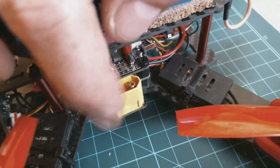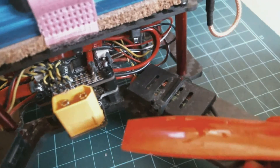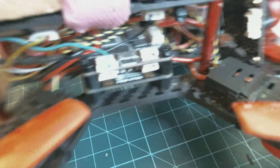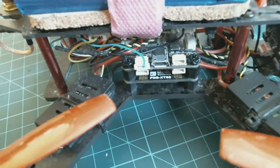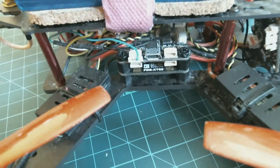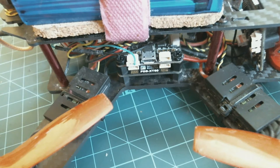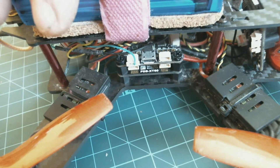Let me recap and point in here — as you can see the XT60 is soldered in, that is the main stack. I put in there, once again from Banggood — I'm a sucker for punishment — an SP F3 flight controller SP copy. It all went in quite easily. I soldered the ESCs along to the new board, took it outside, installed Cleanflight — and it flew absolutely wonderfully, fantastically, just straight out of the box. I mean, in stabilize mode it just took off and sat dead still.